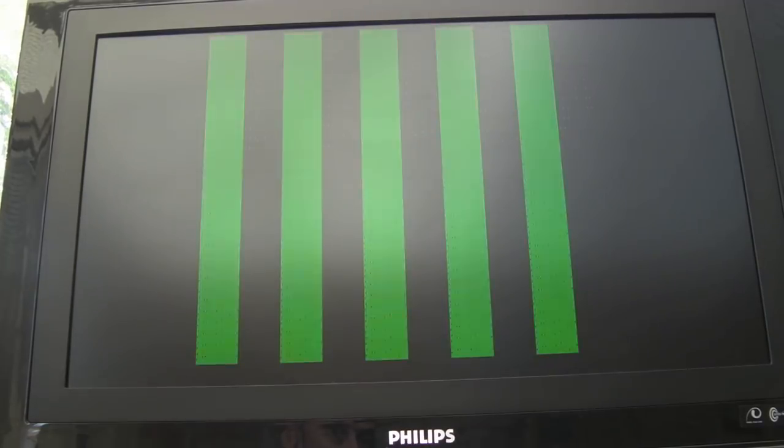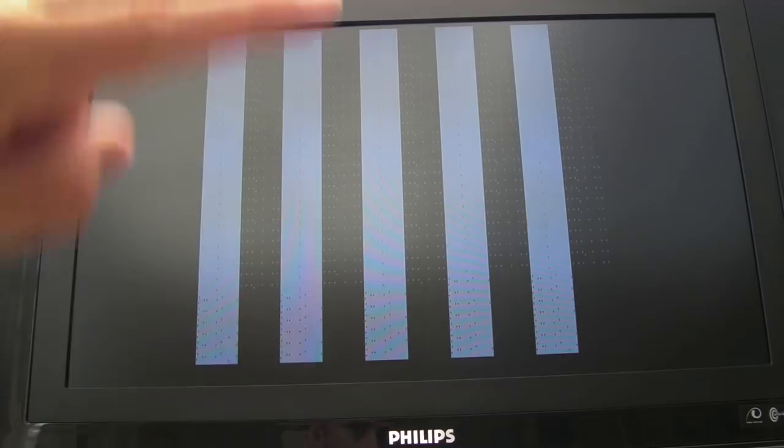Switch it on. Now this has driven me nuts. You see that? It's like some corruptions, and then we get these bands with dots. I thought these little dots indicated a RAM fault, and I was seeking advice on the StarDot forums. People were giving me all sorts of advice about what might be causing it. I eventually tried a software RAM tester, which I'll show you in a minute, that somebody else wrote. I think it's version 3, and that worked okay.